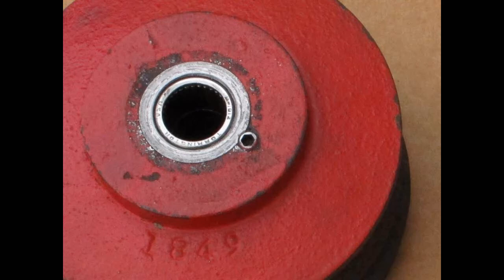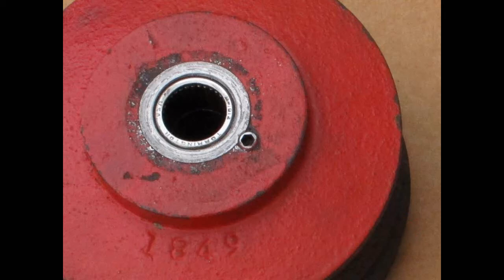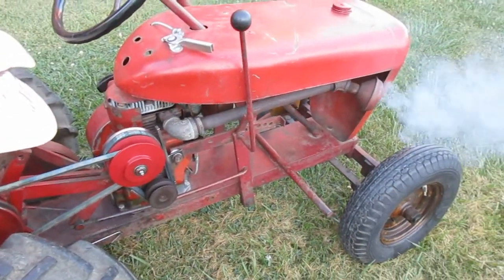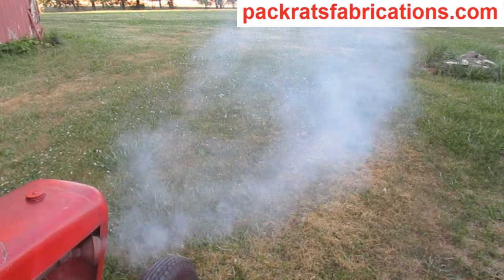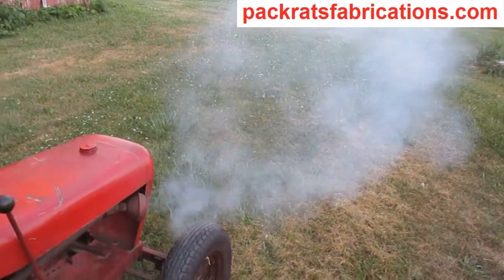On the original pulley set, you can see they used a set screw that goes into both parts to lock them together, even though it's a press fit. I don't know if you'd have problems without doing that, but it's on all the ones I've ever seen, so they must have thought it was necessary. I'll be doing that on the ones I sell, just to make them like the originals. I'll be running this prototype for a while just to make sure it works right. All right, that's it.